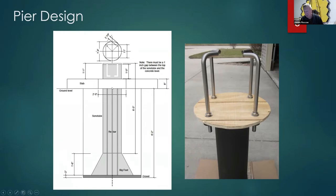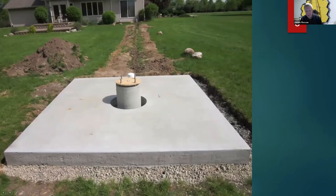the whole pier will get pushed up, regardless. And so I spent quite a bit of time researching and designing the pier structure. I also learned that you want to be able to walk around in the observatory while you're imaging, or if you have to make some visit to the observatory. So the pier is completely isolated from the slab that the observatory sits on.